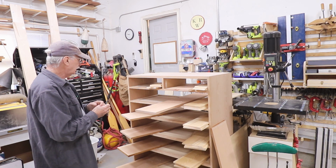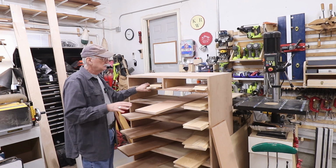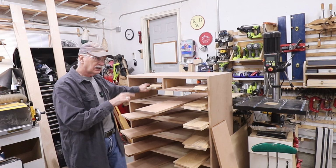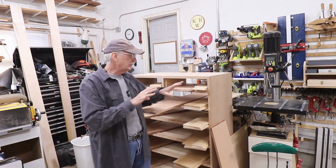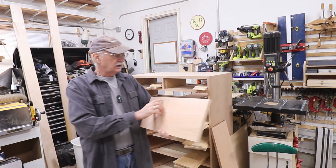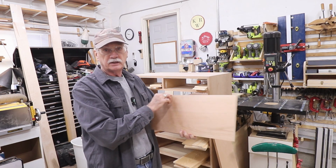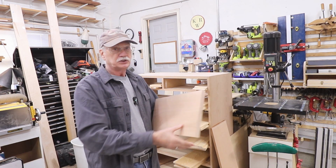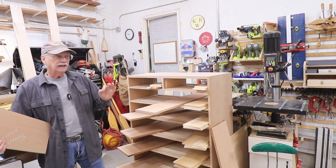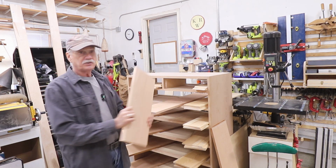So let's get started on a top drawer. Cut everything to fit. Cut the rabbet. Cut to fit, make sure it's the right size. Then the very first thing I do on the fronts is cut the detailing I'm putting on the outside edges of each of the drawers. In this case, it's going to be a 1/8-inch stepped roundover, because this lip on the drawers is 1/4 inch.